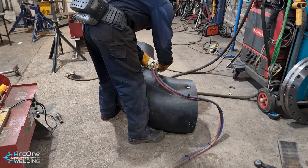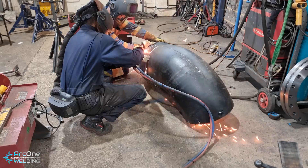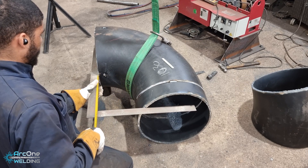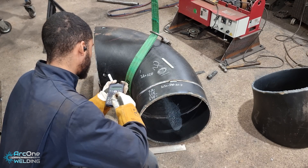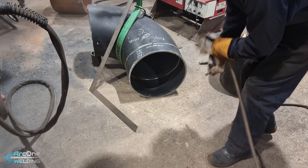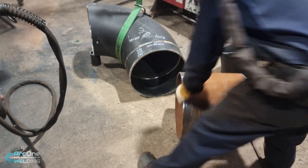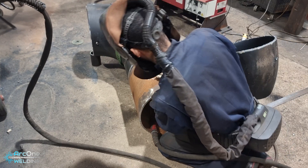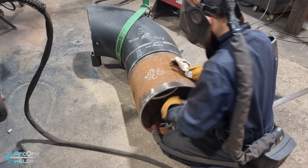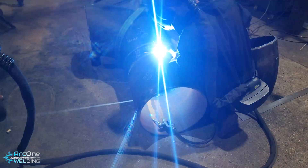Now I'm burning it out — simple as that. My buddy came over to let me know I was running out of gas, so as it was burning it was also welding itself back. You can see me trying to keep the square square while measuring the side of the chop to get a good accurate cut — I could have just pulled the tape measure out to the laser level line. The cut was a little big on one side, but on big pipe you can manage gaps. I tacked the bottom and picked up the elbow to close the gap at the top.